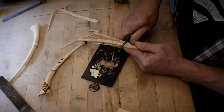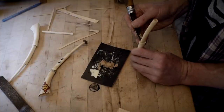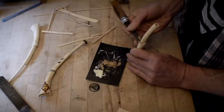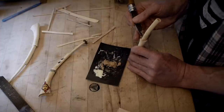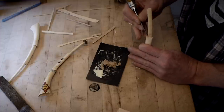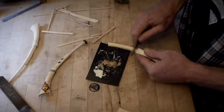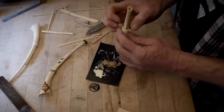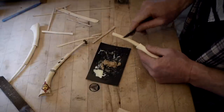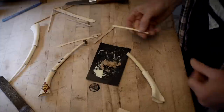So I'm going to score this and trim off the extra. I'm going to get it nice and clean. There's a little hole right there - I'm just going to shove that splinter down in there and pack a little of this in there. I think this is probably going to work pretty good. I really don't think this is going to shrink very much. If it doesn't shrink too much, all the glue bonds will stay intact. The splinters will be glued to the sides and to the sawdust, and if it shrinks enough some of them will pull away and break.